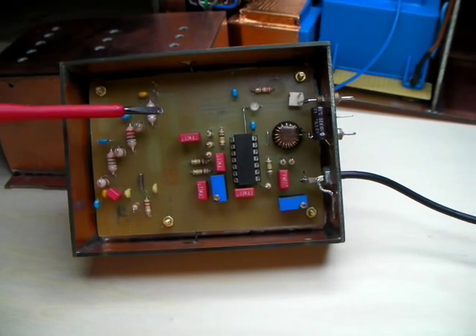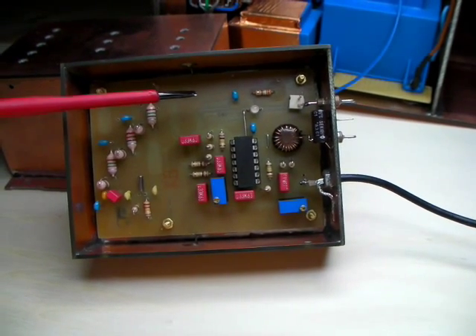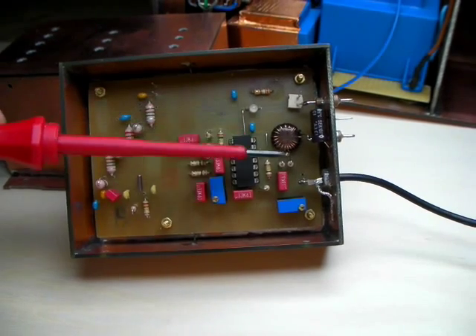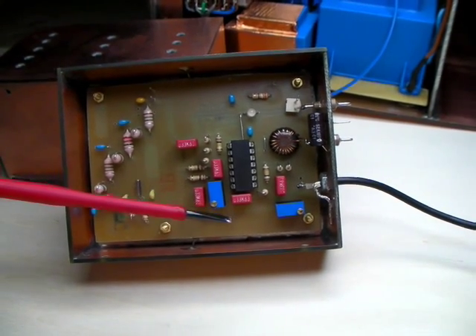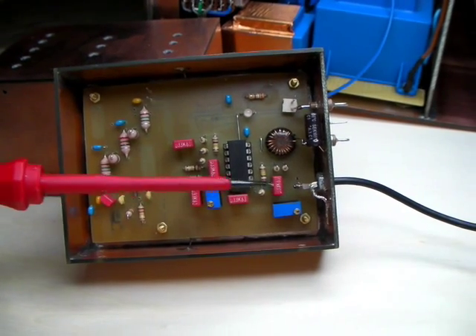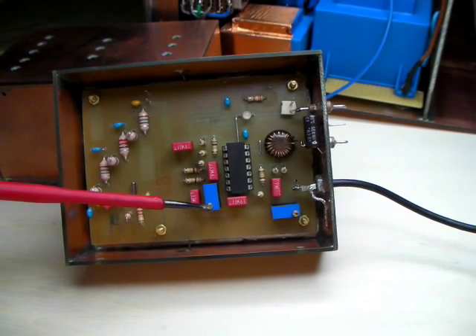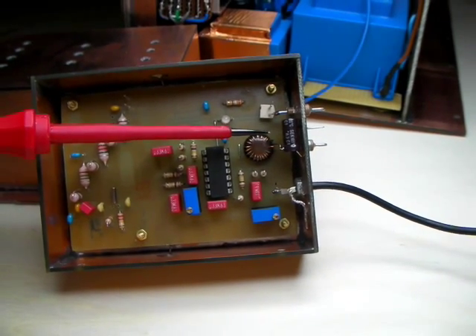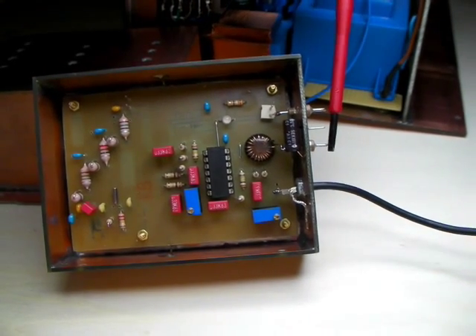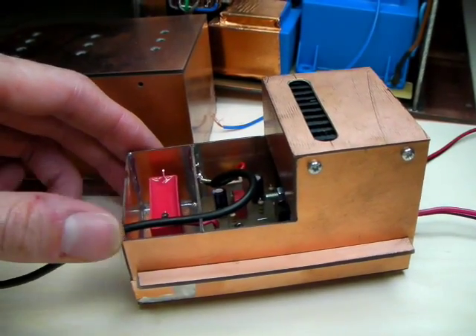You can see the little coils here. It converts the signal to a sine wave, which looks pretty nice on the scope. Then the sine wave signal goes into the level shifter, which is a CMOS switch circuit allowing you to change the output signal from 100% down to whatever you adjust — in this project it's 20%. The little coil and capacitor here form a low-pass filter to protect the power supply connected to this pin.